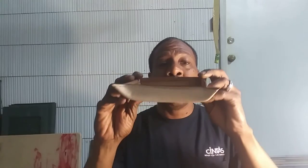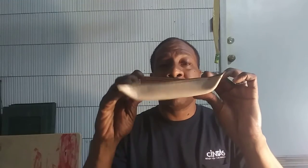The great part about wet molding done this way is you can leave it outside and let the sun dry it. Once you've pulled all the air out and got it nice and tight, leave it out during the day. If you're out west where it's not so humid and it's dry weather, two to four hours max and you know it's thoroughly dry — all that moisture pulled out. By the time you pull it out of that vacuum bag it will be a perfect square. You also need to level out all the warpness so the tray sits flat.